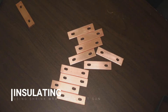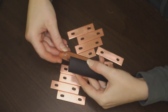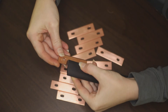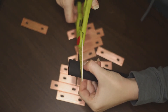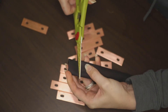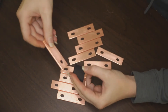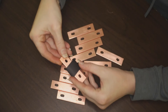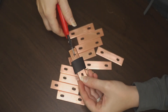Technically, bus bars do not need to be insulated. But all the exposed copper poses a danger. It's too easy for some conductive material to drop on the bars and short the battery cells if we don't protect them. Adding shrink wrap does not entirely remove the risk of shorts because they will still have some exposed copper to make the connection, but it helps. We cut the shrink wrap just long enough to cover the length between the two battery terminals, then use a heat gun to shrink the wrap as a tight insulating cover. This process gets hot, so we use a pair of pliers to hold the bar and let them cool off in a metal bowl.